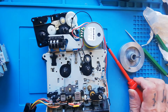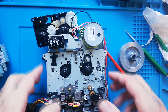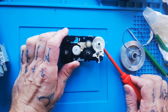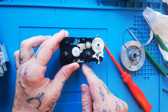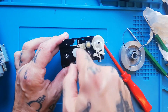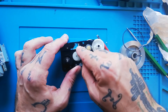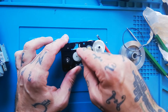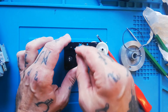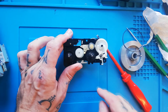Maybe that fixes your problem, but I've had two machines and seen others in forums where that hasn't been enough. The other step — again not my innovation, but from someone in a Facebook group about fixing Portastudios — is that the spring wasn't strongly enough pushing the idler wheel against the take-up reel. Their solution was to unhook the spring, cut two or three winds off it, then use needle-nose pliers to fashion a new hook. The shortened spring creates more tension, pushing the idler wheel harder against the take-up reel, and that fixes the problem.